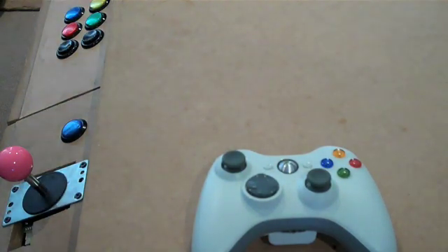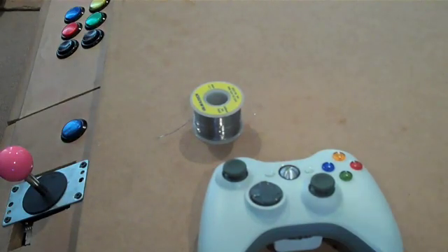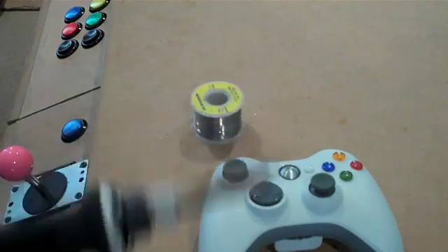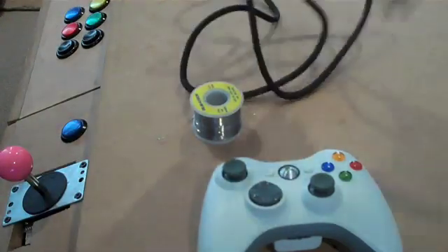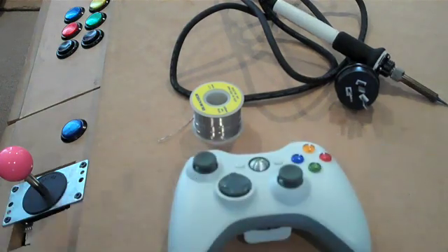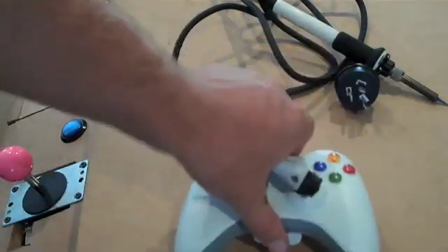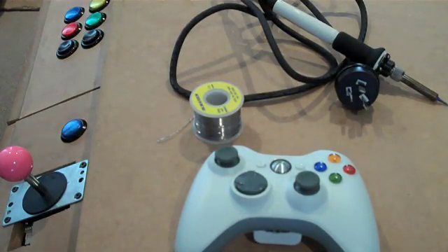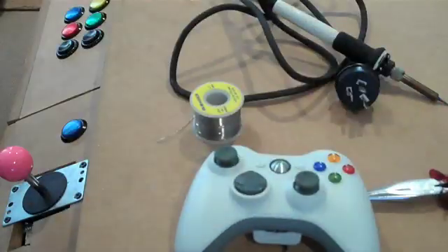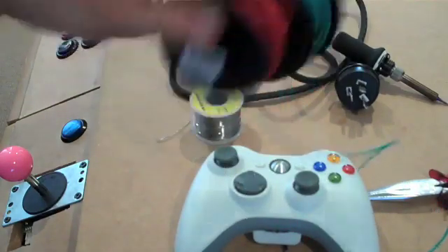For soldering you're going to need solder — pretty much only sixty percent tin and forty percent lead, which is what I'm using. You'll want a pencil-tip style soldering iron. This one cost me sixty dollars from Jaycar, but it is much much better than older ones. I highly recommend getting a different iron if you've got a big fat nib — a skinny one makes it a lot easier since there's some really quite small soldering to do inside. You'll also need a T8 torx screwdriver for the seven screws on the back of the controller, a flat head screwdriver to scrape off the contact material inside the buttons, and some wires — I'm using two colors: green for ground and red for signal.